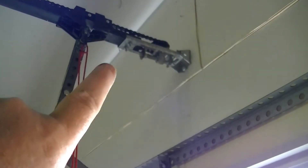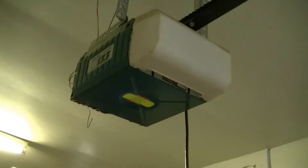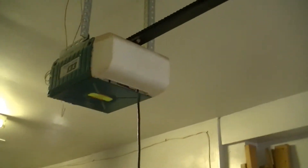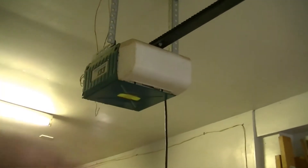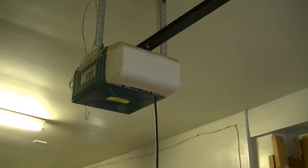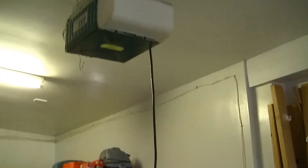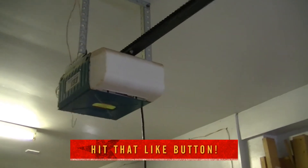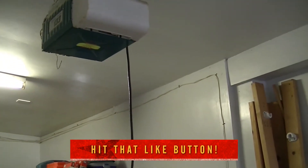The first step to taking down the old unit was disconnecting this lever and leaving this bracket on the garage door. I think that's going to swivel — I may have to take that down. You should really have two people doing this, one person holding that. I came over to this end and there are only two nuts up here on the bracket, one on each side that hold that in place. I've got the ladder positioned and I took the nuts off, so hopefully I can hold that up and take the two bolts out, then lower that unit on the ladder because it's kind of heavy.